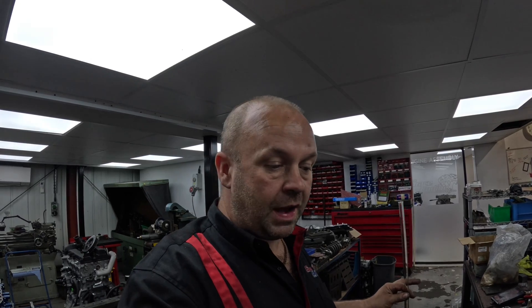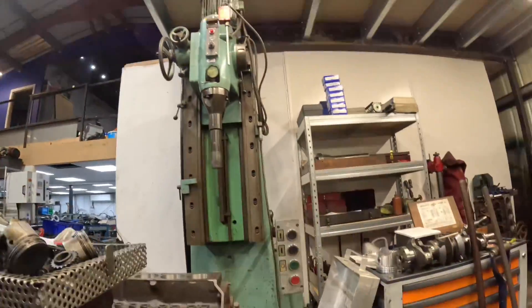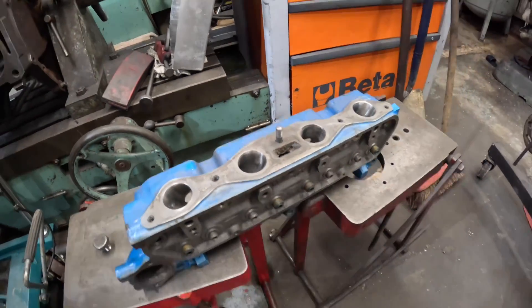Then I'll just copy on the other pistons the same depth straight away and then just re-measure them all. The cylinder head - I've re-worked that and tidied up the porting, made sure it's all equal. I've got to skim it now. But that's the cylinder head all nicely ported and opened up, especially around the valve and around the guide and everything. So that just wants a re-face now to get it at the right height, get the valve sitting where I want them to sit, and then we're done. Wash it and we're done.